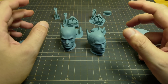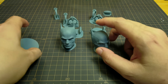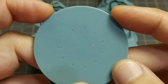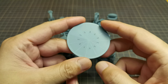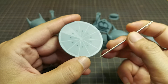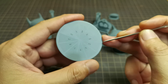This is very unique because usually with antialiasing it simply works or it doesn't. On the Mini 8K, antialiasing is only not working on surfaces facing the X axis. Hopefully Phrozen engineers get to watch this video and understand the issue — I have already confirmed this with several users who need antialiasing for their work. Looking at the grayscale test print, it printed very well, so I believe this issue can be permanently fixed, but it is completely beyond my capabilities. Please, Phrozen engineers, if you watch this video, fix this issue. Let me know your thoughts in the comments. Thank you for watching and see you in the next video.